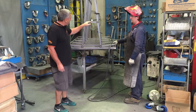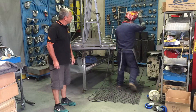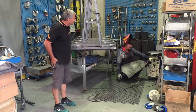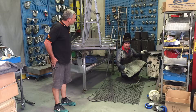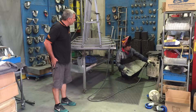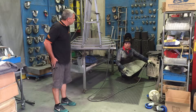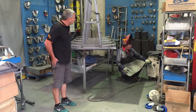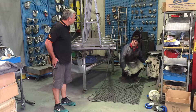Brian, how have you set the machine up to achieve such a good weld? What's the wire speed set on? I've got the wire speed on about three and a half. If you go any quicker than that, the gun starts jumping. And I've got the power on about four, so it's about halfway. If you go any hotter than that, you have to work way too quick and you end up blowing holes in it. I find that's a perfect standard setting for what we do at Aussie Trolleys.